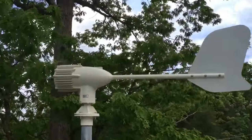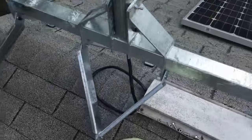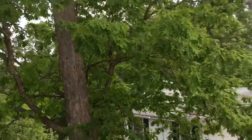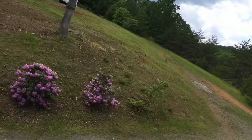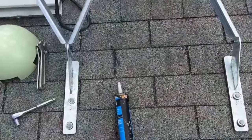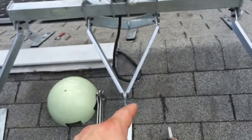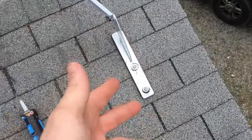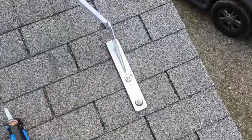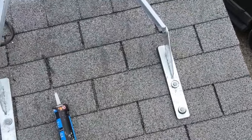At this portion in the build, we have got our turbines in place ready to receive the hubs. These also have a lovely cover over them so you can paint them however the customer sees fit. It is a tapered shaft on the unit. What I'd like to point out is the effort that we take to make sure you have a perfect install when it comes to wind power. We have the wire coming out siliconed. We're going to silicone all the superstructure area in a minute. The pylon pads are siliconed after it's drilled, then silicone is applied on top of that, then the rubber gasket, then another rubber gasket on top of the metal, then the bolt, which also receives silicone. So as you can understand, you're not going to have a leak problem.